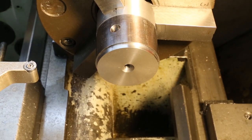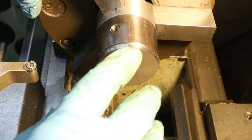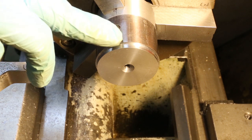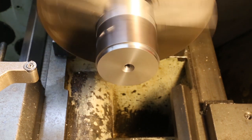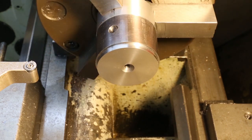I've just put the job back into the chuck of the lathe. I put a clock on the outside because, as we know, three-jaw chucks are not brilliant at bringing jobs bang on centre again. There was a little bit of runout and it wobbled a bit. I found the high spot, tapped it a couple of times, and now it's as best as I can get it. The chuck is done up nice and tight — you can see there's a little bit of runout but not too bad.